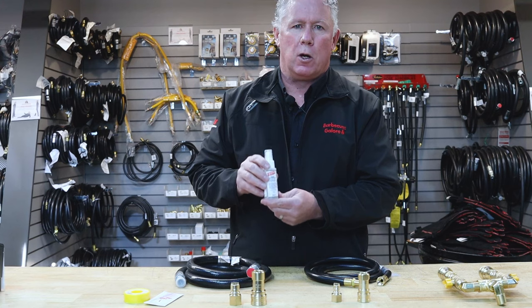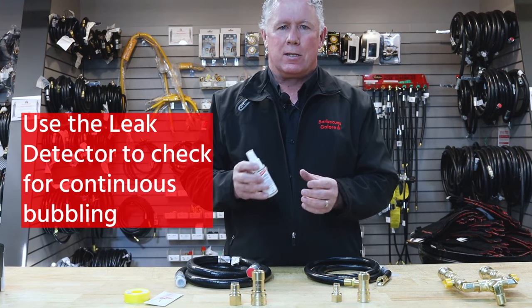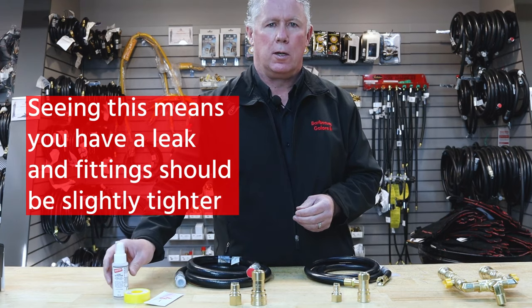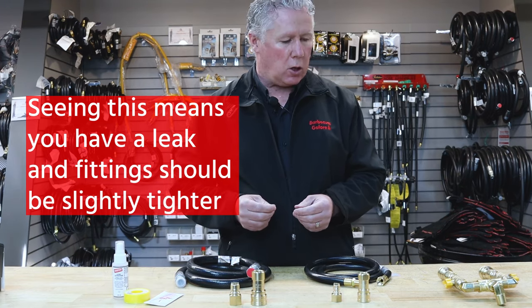The tester is designed to put on after you've assembled all your fittings. What you want to check for is any concentric bubbling — that means bubbles with bubbles inside that continue to pop. That'll tell you that you have a leak, which means you need another quarter turn, then put the liquid on again, give it a wipe, and you're set to go.